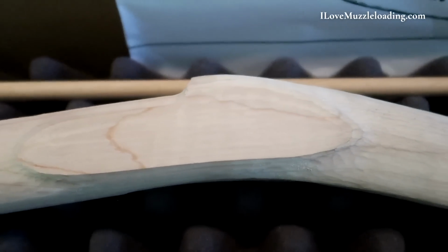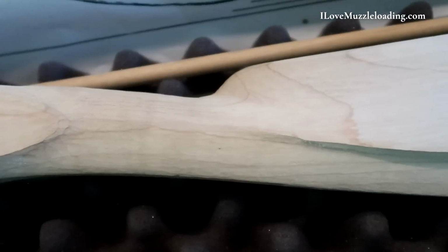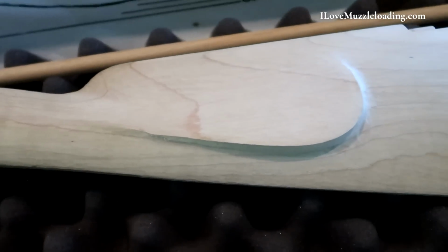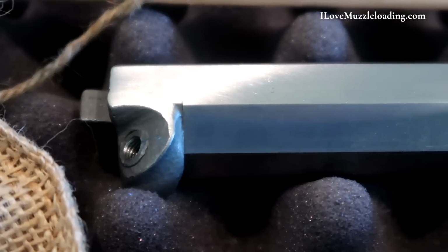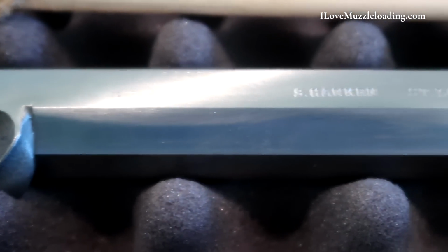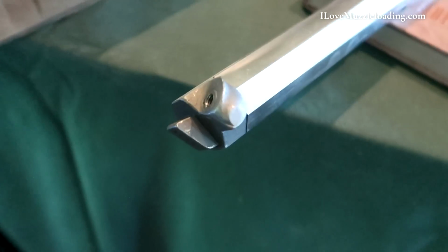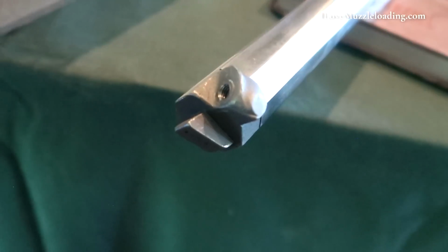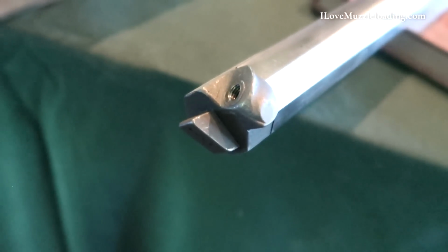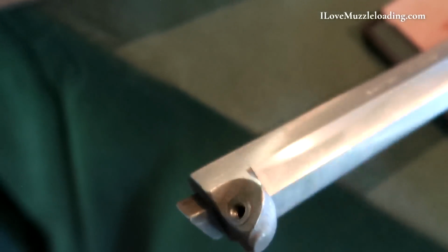And we offer them at higher grades for those who want them, a grade 3 and a grade 4 and even a grade 5. And basic is just a reflection of the amount of curl in the rifle. The next you get is the barrel. As you notice on that end, the bolster, it's a hooked bolster breech, is already installed. And it's been machined, and it's installed, and it's indexed upright. In other words, the bolster's 90 degrees out and everything works.